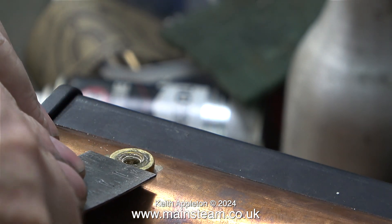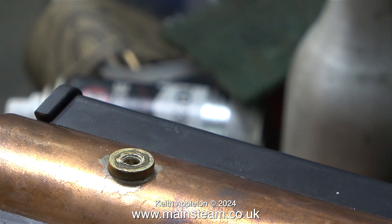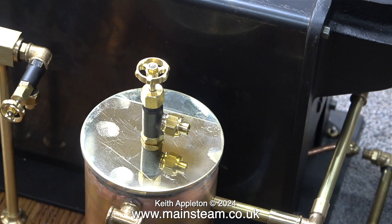Using the edge of a steel rule, I'm scraping off the residue from a previous application of Loctite 542. The question is, should I fit a Stuart tap like this? The answer to that is definitely not. Fitting commercial boiler fittings is a bit of a balancing act between scale, personal taste and tradition. For instance, I would always use a Stuart valve on a 504 boiler, but as this is a much smaller boiler, to my eye it doesn't look good. What I think I'm going to do is use the same type of valve that I fitted to the top of the condenser — that way there will be a match between the steam turret valves, the boiler output valve and the condensate drain valve.